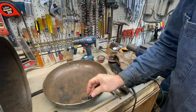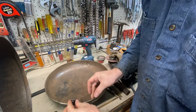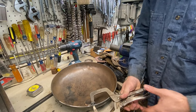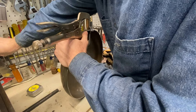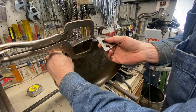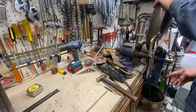If I weld it up here — we know that this edge was cut from this edge — I don't want to weld it on the edge or it gets in the way. It would be too low to get some clamp action on it. Then we can straighten it out — we can even put a square on it and just check our work. That looks pretty good.